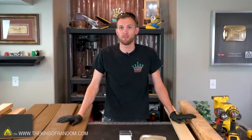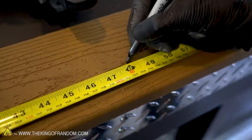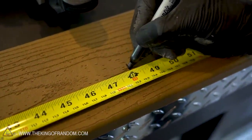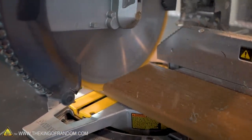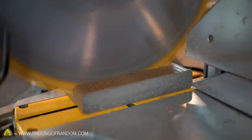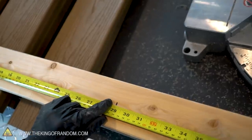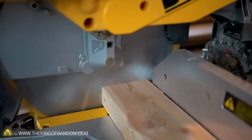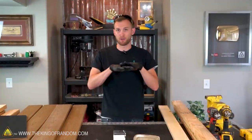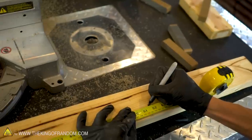Let's start by cutting all of the major pieces we're going to need for this bench. First up is our composite board, and we need 9 pieces that are 4 feet long. These boards are almost exactly 8 feet long, but they have enough extra that we'll probably do a little bit of trimming. There are several pieces that we need to cut out of our 2x4s. The first is the legs, and for that we need 4 pieces that are 29 inches long. For the support pieces that run parallel to the ground and hold up the benches, we'll need to cut 2 pieces that are 51 and a half inches long.